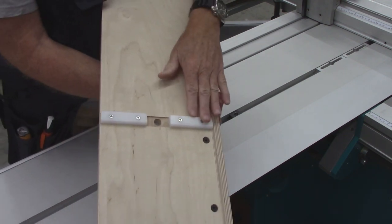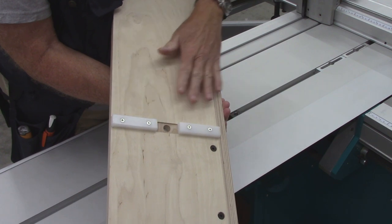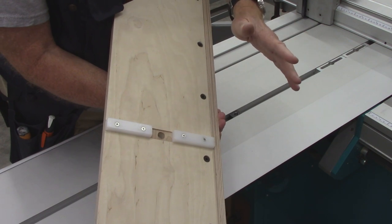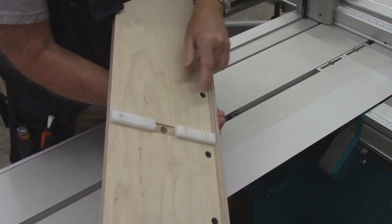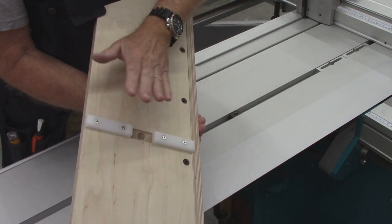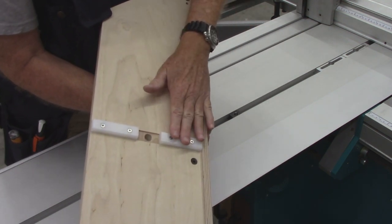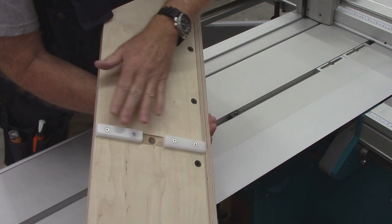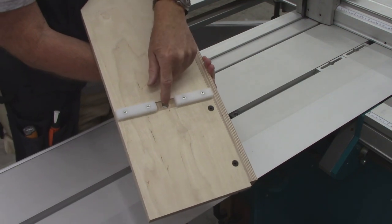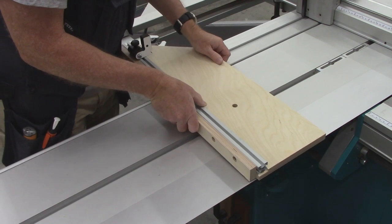And for the bottom of the jig, I used HDPE instead of the hardwood runner. The hardwood, I used oak before. It's held up fine. It's as tight now as it was the day I built it. But the HDPE, I wanted to split this in the middle. The wood I would glue in, this I just screwed in. So this is replaceable. If this doesn't hold up well, I can either replace it or even go back and glue in hardwood. But I left a gap here and drilled a hole such that I can locate that T-slot nut.